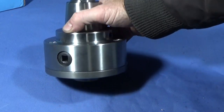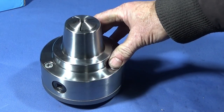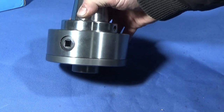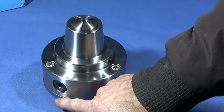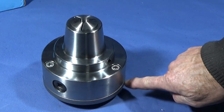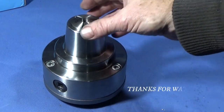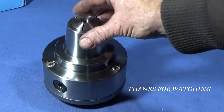That's the back plate fitted and I've got the runout to be less than half a thou. The only thing I've got left to do now is to put the holes around the outside for my indexing equipment. I think it's a brilliant chuck and well worth the money.